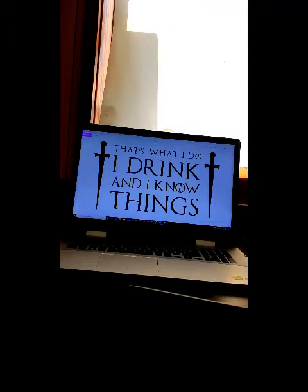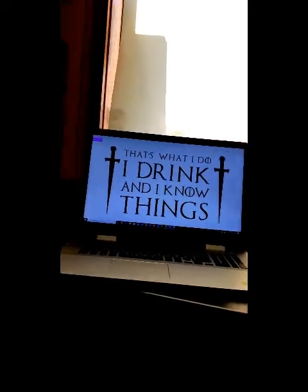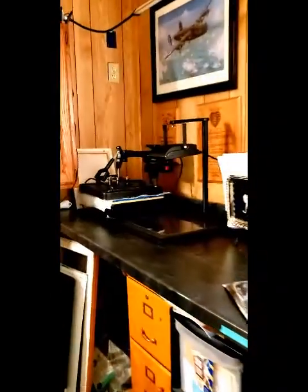I got it on the correct side. It's almost done printing, so I'm going to move you over to the actual exposure machine. You have to expose for 30 to 45 seconds, and then after that what we'll do is we'll take it upstairs and get it running under water. So here it is — it printed out on the correct side.